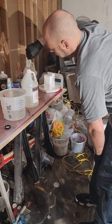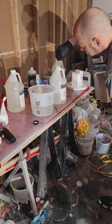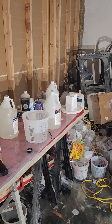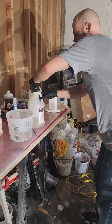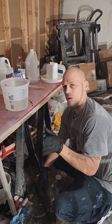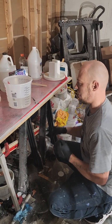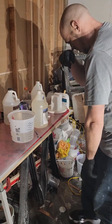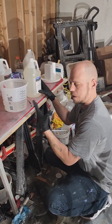I'll add this all back in and the rubber mold goes to the wash station to be cleaned and reused — definitely a lot less messy when you have these little gadgets handy. There is our hardener right on the mark. That actually happened by accident, so I'm glad it did because I may not have thought to show you. This is where it really matters. Now we can safely start adding the Part A resin — this is where you need to be careful as you approach that four-liter mark and do not want to go over.